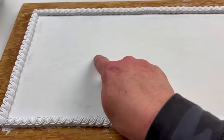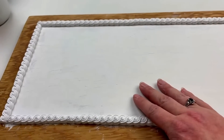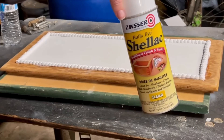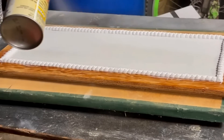Here's a coat of white paint and you can see there are tannins bleeding through — I don't want that to happen for the next step. So I'm going to take this out to the garage and spray a coat of shellac to stop that from showing through our paint and into the final project.